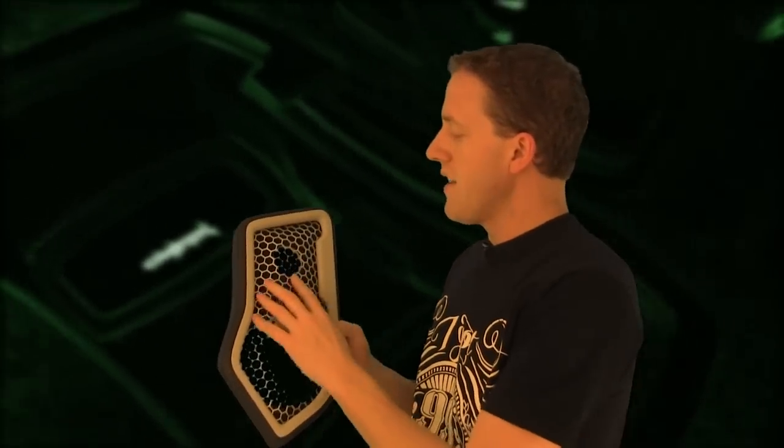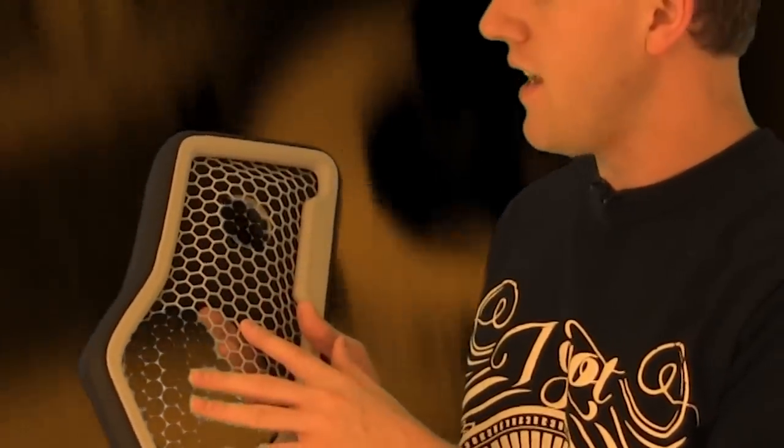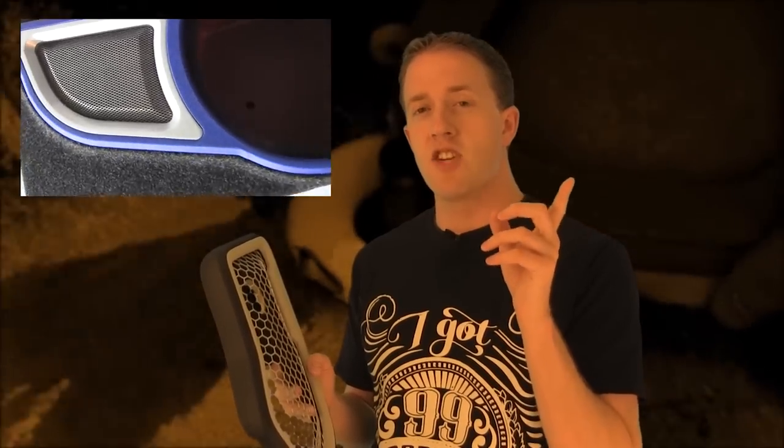A few additional tips when you're forming metal mesh: you can paint your metal mesh in order to accent it with a different color, like a metallic red. Anything that can change up the custom look is a good idea. I actually ended up adding a metallic silver and then clear coating it just to give it a little bit different look. Also note this metal mesh has a very large open area — I believe it's actually a half inch between each of the hexagon shapes. When you have a large open area you need to draw the metal more when you're molding it in order to be able to see the actual curvature of the bend in the mold. I encourage you to check out one of my other series where I molded a much finer diamond mesh where you can really see the curvature. I'll put a link on the screen so you can check that out as well.